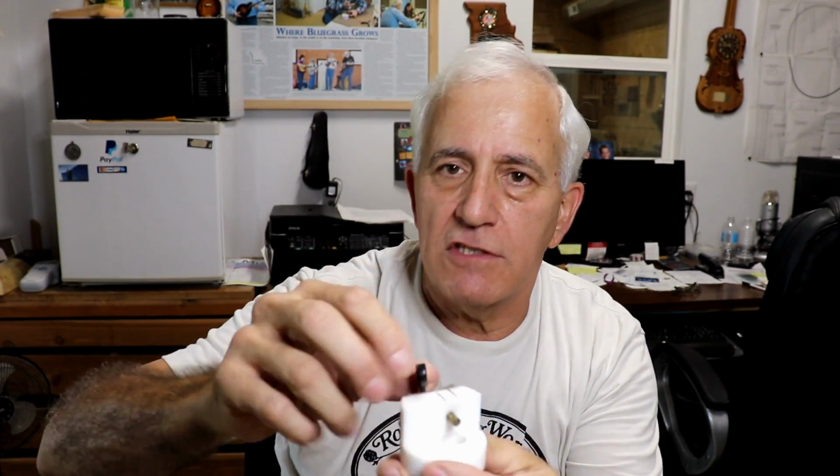Let's say you've got a crack that's uneven on the top of your guitar. We'll say it's closed up, but it's uneven for whatever reason, or maybe there's a slight sag there. This is a lifting clamp. It lifts. You have to drill a hole through your top. Don't get me wrong, you think, drill a hole through your top? Well, you use just a little tiny wire drill, I mean, smaller than the end of a toothpick sometimes.